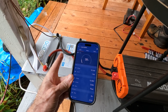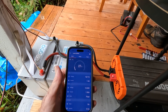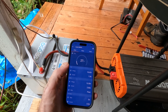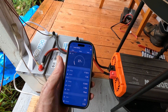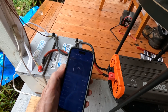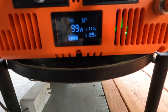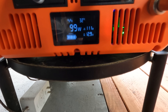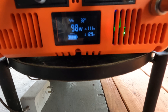I'm actually glad to be using these batteries — I haven't really needed to, they've just been kind of sitting here ready, and now I need them. 27 watts coming in off the panels now, just keeping it going along at 13.5 which is the float voltage. Pulling about 18 to 19 watts, waiting for that freezer to kick on, and hopefully those panels will open up a little bit more. Mission accomplished — it took a few minutes for the freezer to kick on, but you can see it's drawing 99 watts right now. The normal cycle for that particular freezer is 50 to 60 watts while running, so that's just the initial startup.